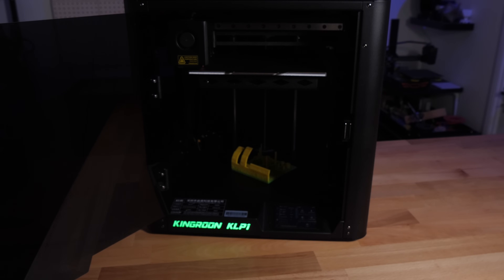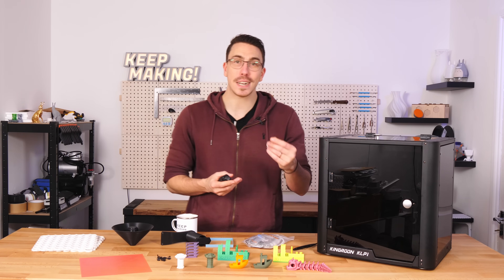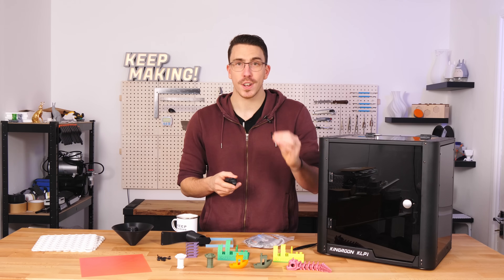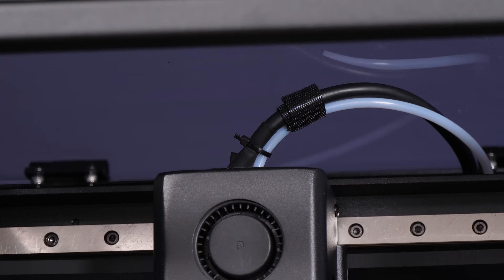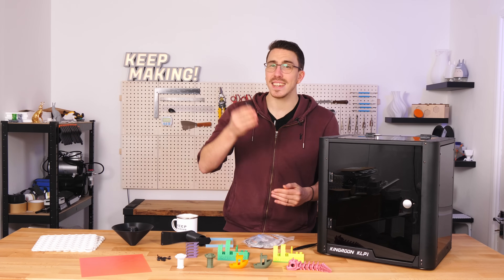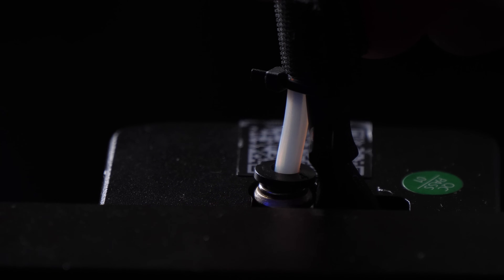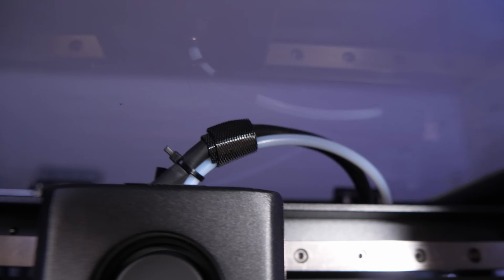If they're going with a dark look, at least add some LED lights inside, because right now it's basically a dark void. Also, that top acrylic cover sits so close to the extruder that it forces down the extruder cable and Bowden tube, making them do a sharp turn into the extruder. That adds needless excess friction inside the Bowden tube, which could lead to under-extrusion, and during manual filament changes the filament always seems to get stuck right at that bend. It's also wearing out the extruder cable as it rubs on the enclosure.